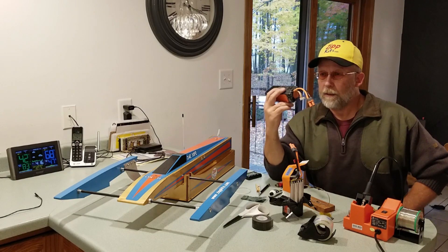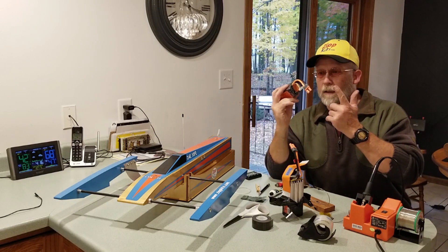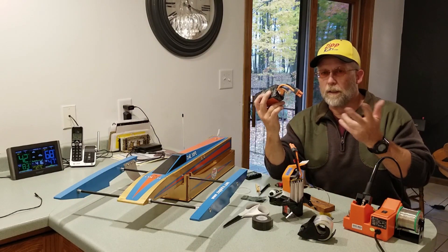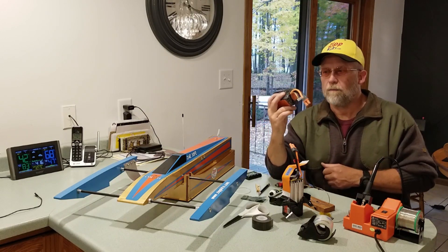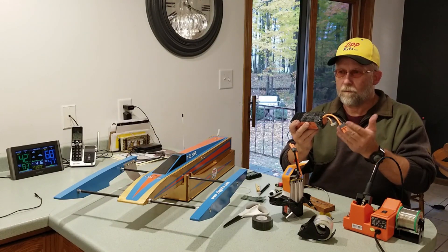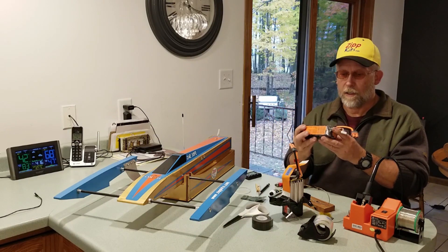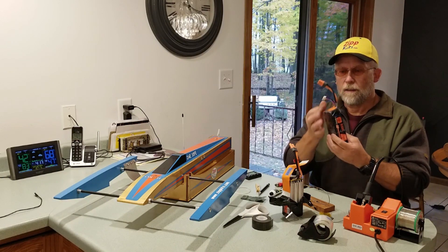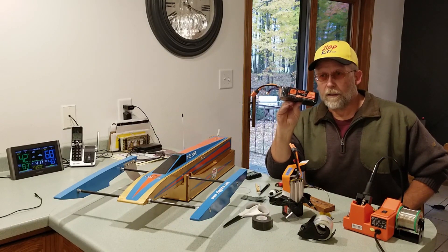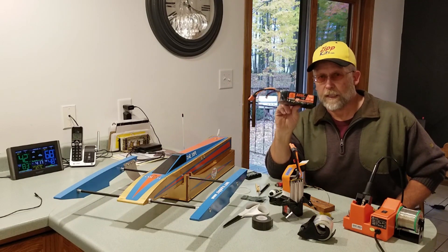Kind of a shame to spend that kind of money and have them — what I thought was — fail prematurely. It was showing up when I'd put the Spectrum tester on it or hook it up to the charger; either be a cell or two, it would be 0.06 volts, one was 1.94. So due to all that corrosion on the board, something wasn't reading right in the cells, and therefore the charger couldn't charge it. Now that I have this on here, I know that this battery is still good. It's not failed — the LiPo part of it, the cells haven't failed — just their Spectrum technology has failed.